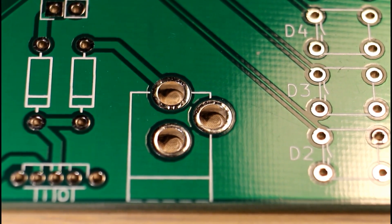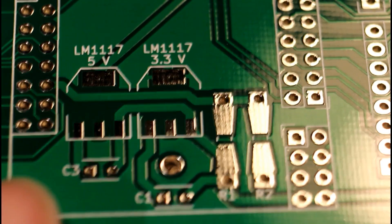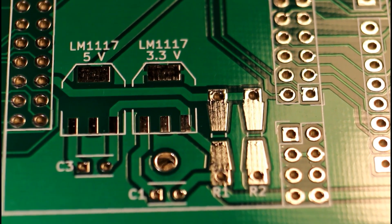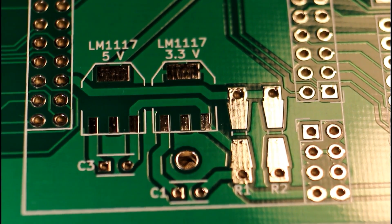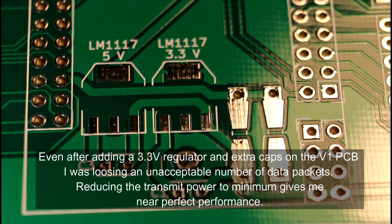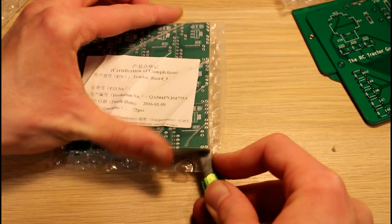There's an on/off switch down here, out of the way, so it hopefully won't be easily knocked on or off. There are a couple of dedicated regulators on here so I'm not relying on the Pro Mini's power supply — five volts for the infrared and 3.3 volts for the radios, plus lots of capacitors. I'm using LM1117 regulators so this should be good for about 800mA, which should prevent voltage drop issues that might have been a problem with the NRFs on the previous version.